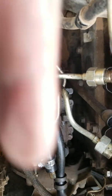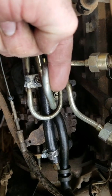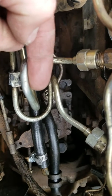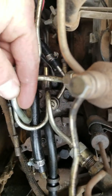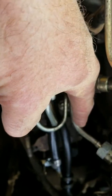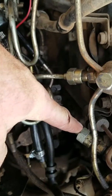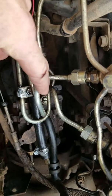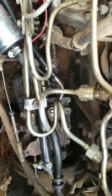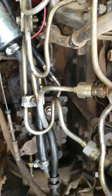You can kind of see the injector pump down in there - it's gear driven. Right there on top there's a flathead screw, and that is a bleed screw. It's also a 10 millimeter on this machine. It's a real pain because this fuel line is in the way. I take that nut off completely to move it aside.